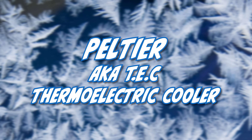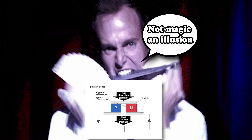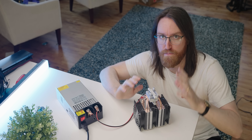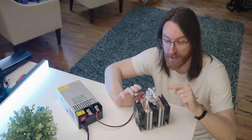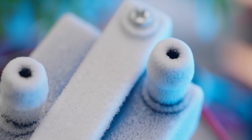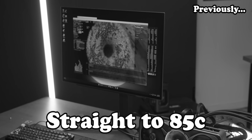This tiny little white plate that looks like something a dentist uses to ruin your childhood is a Peltier, or thermoelectric cooler. It's a little device that uses electricity to make one side get super hot and the other side gets super cold. Here's one running with a heatsink cooler where the cold side's gotten so cold there's a bunch of frost building up on it — an effect which I tried to use to cool a graphics card in a previous video, but that was a complete disaster.